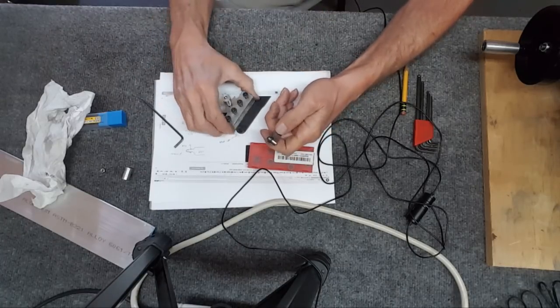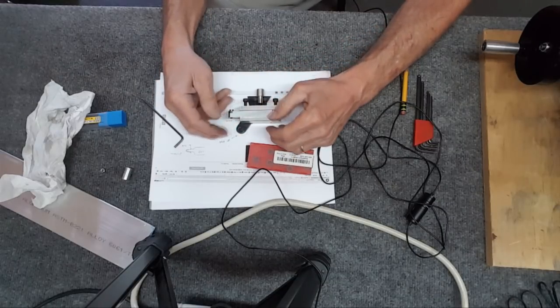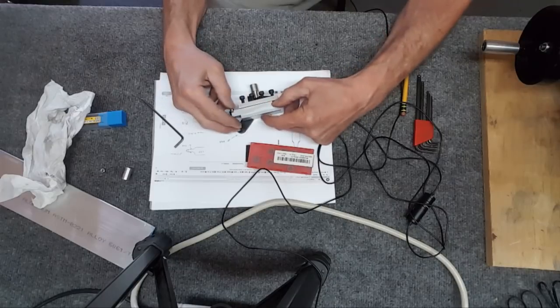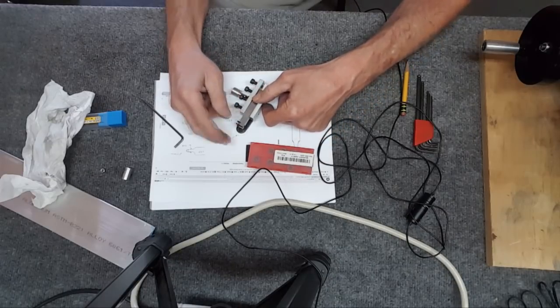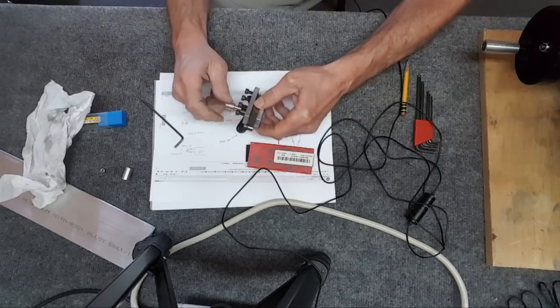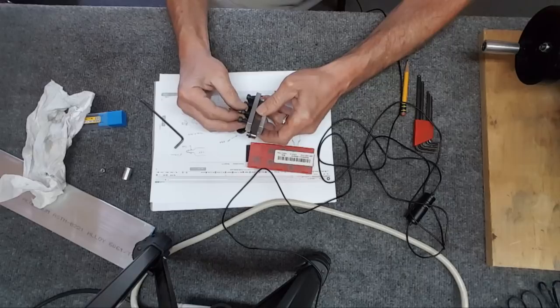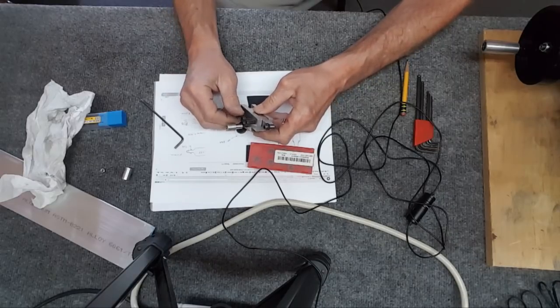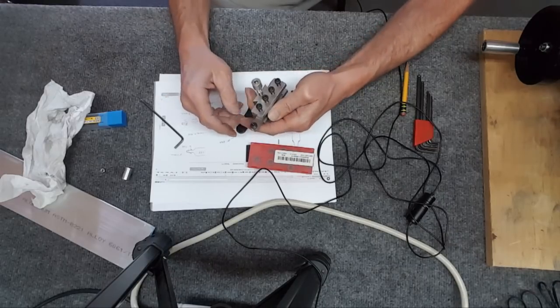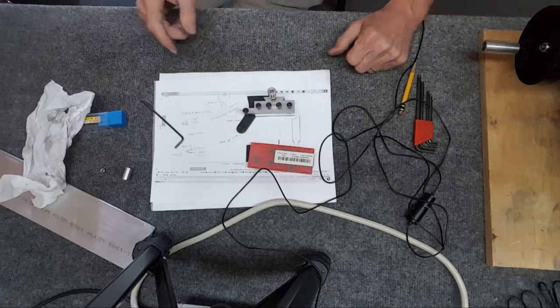Had to modify this guy so it fits, because it was for the Harbor Freight 1/4 inch guy. So there we are. I've got relief on it. Yep, everything looks good. Now it's a matter of setting the height, because I'm going to try this on the old lathe. So 666 thousandths to set the height.